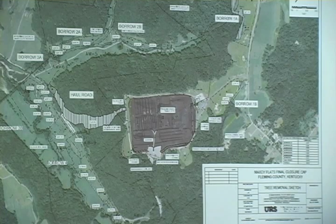So that just kind of orients you as to what this is. The point I'd like to make is this is on kind of a spit peninsula of flat land up here, with real steep slopes all the way around on three sides. That makes it a real challenge because normally when we build a cover or a cap over a project, the footprint increases in size. We didn't have anywhere to go when we put this dirt on here.